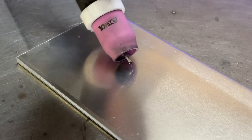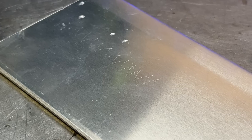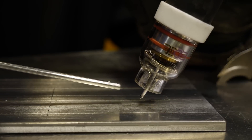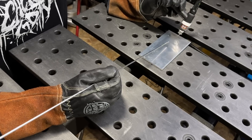Typically somebody can either walk the cup, but honestly I never do this with aluminum. The reason is that aluminum is a much softer metal, so you could be walking the cup and laying down a really nice looking weave pass while at the same time scratching it with the edge of your cup. What I personally prefer to do — and what I teach in my programs — is the exact same pattern but freehand. It relies more on hand motion, but I don't scratch the surface and I find it much easier to teach filler material feeding and visibility.